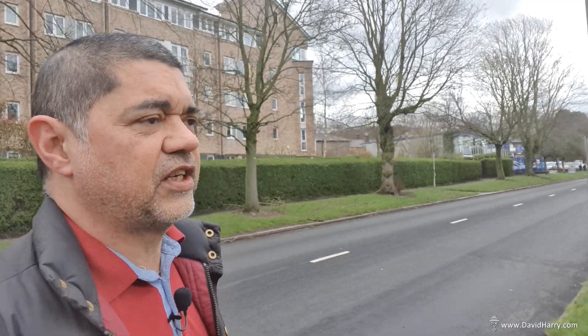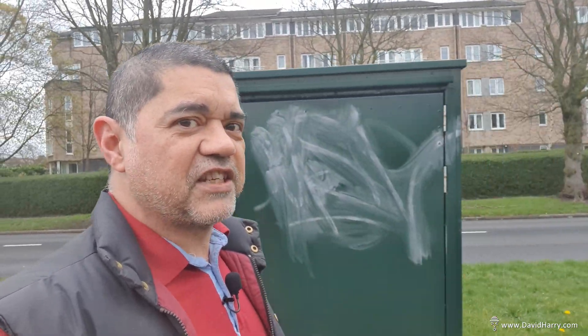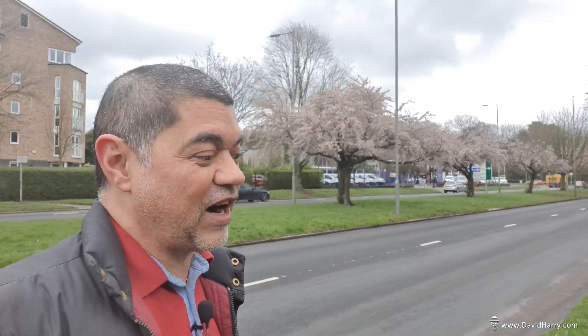The first outdoor test is recording myself right by a very busy main road. I'm actually standing in between the dual carriageway. The idea for this test — and I wouldn't recommend vlogging where you're not concentrating on crossing roads — is that there was a gap in traffic so I wanted to get across safely. The reason I'm testing in this environment is because the microphone is omnidirectional, meaning it will pick up equally all around. But because I am the closest sound source — my mouth and voice — I'm hoping it's picking up my voice more than all the surrounding traffic. This gives an idea of how well it isolates me from that noise.